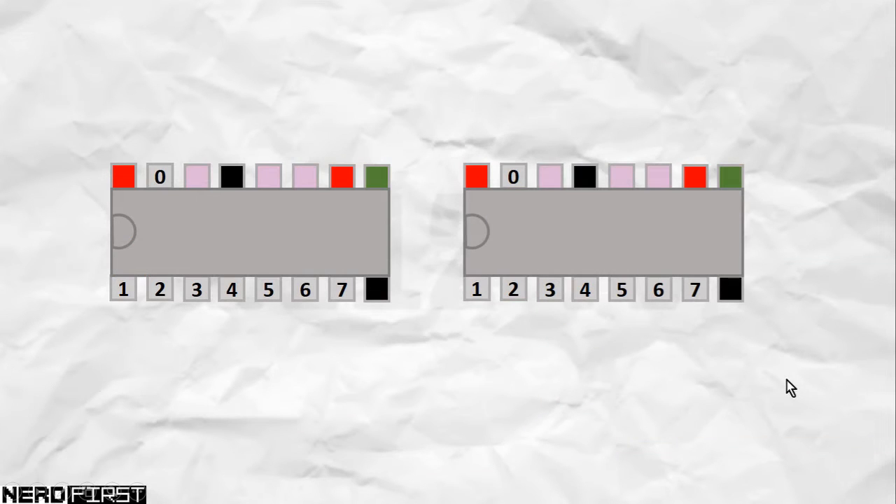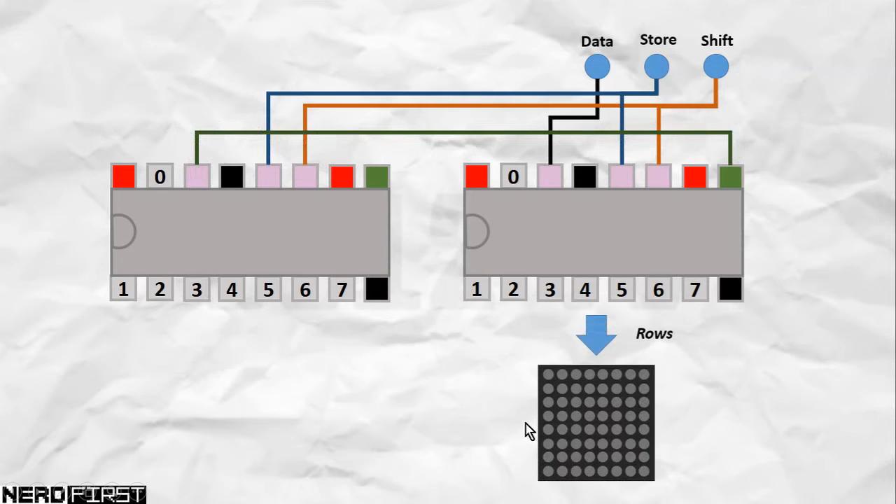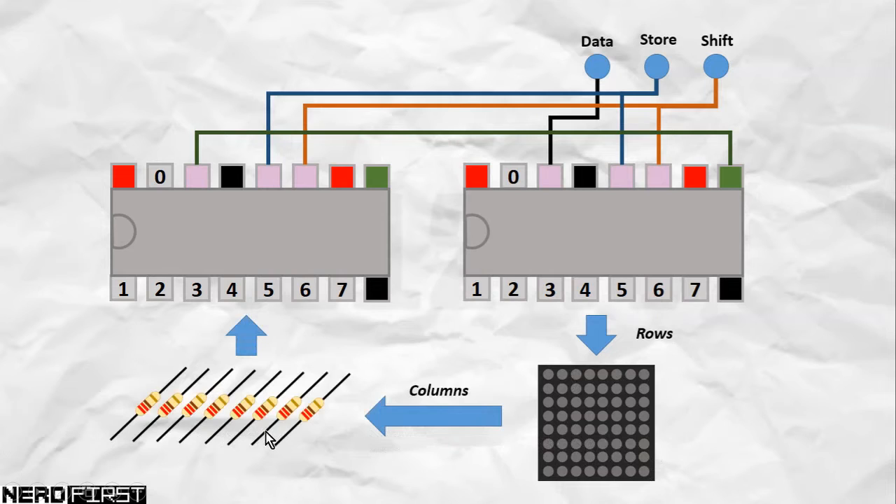Let's take a look at how we are going to connect everything up. The pins coming from your Arduino will feed the two chips as described earlier. Note that this is our first chip and the second chip is on the left, which is why the output from the first chip is being chained to the one on the left. Our first chip is actually supplying the rows - this is the one doing the scanning - so only one of these pins will be high at any point of time. The current goes out through the columns through a series of resistors back to our second chip, which has all the varying values allowing us to draw out the individual contents of every single line. This chip will act as a sink.